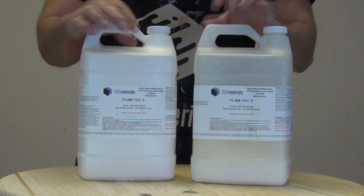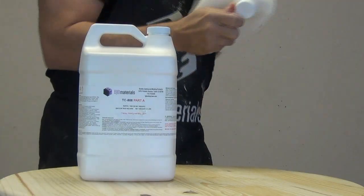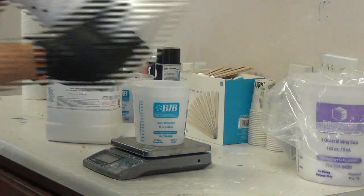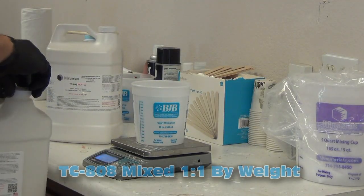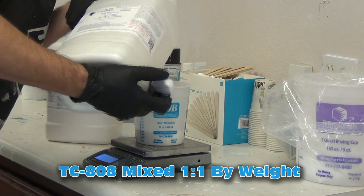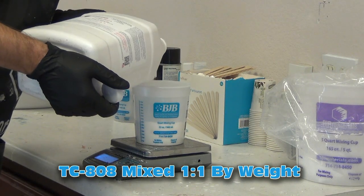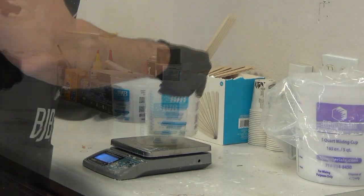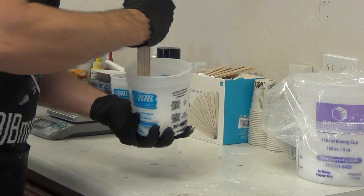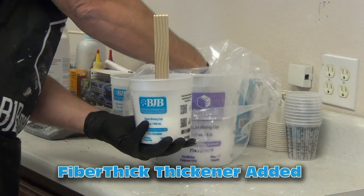Because I want to get just that area of the mold, I want to make the resin brushable for this application. We'll be using the TC808 polyurethane resin. This is a fast-setting polyurethane resin, and of course that B side will settle out — you want to make sure you shake that B side up really well before each use. This resin mixes one-to-one by weight. Different than the head where I sloshed it around, this time I'll be weighing out my resin and then thickening it with fiber thick.